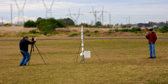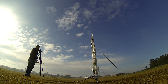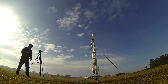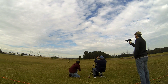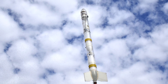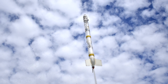For the next picture we wanted to get the whole rocket in the frame a little bit further above the launcher, so we first set up the manual focus for about that distance and then pointed the camera further up. You're probably thinking why not just capture a frame from a video of the launch, but the big difference is the much better resolution we can get from the single photo, which is 6000 by 4000 pixels. We set the delay to 200 milliseconds for this one, and here's the shot we got. We'd love to hear any suggestions in the comments below on how best we could use this capability.